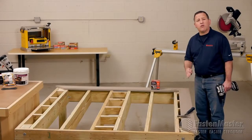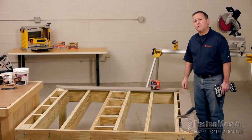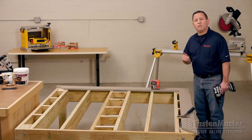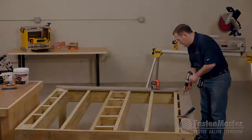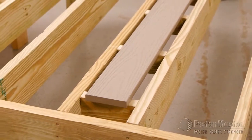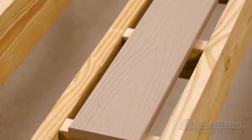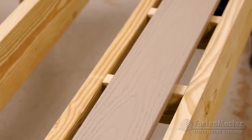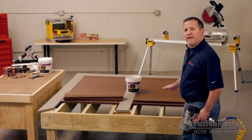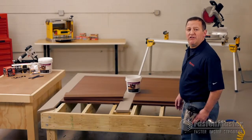The perimeter board is no different than our first and last board — two Cortex screws and plugs every 12 to 16 inches on center. Many times, breaker boards are used as a way to eliminate seams in the center of the deck or around design features such as herringbone patterns. We're finishing up the field of the deck using our TigerClaw TCG clips.